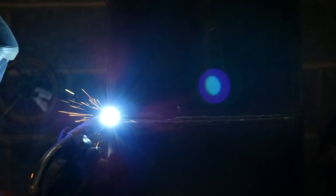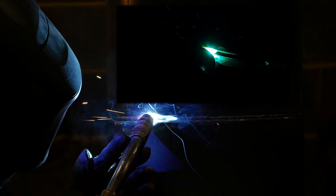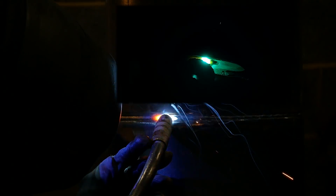The root came out okay. I'm going to cut out the tacks and feather back the starts and stops to a nice smooth transition so you shouldn't see my tie-ins. Quick apologies — I thought I'd have more arc shots for this video but most of them my head is blocking the camera. Here I'm moving up and down, keeping the molten pool moving — I don't want to stop at any moment because the metal is still going in and you risk dripping through. I'm focusing most of my time on the elbow at the bottom because it's thicker and gravity is pulling the molten pool down anyway, otherwise you get undercut.